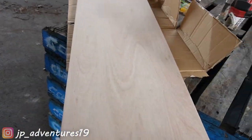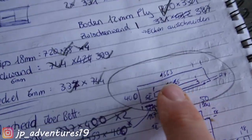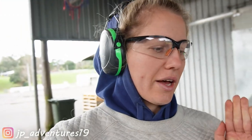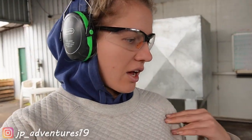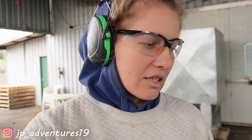The floor of the overhead cabinet is cut out and I already sanded it with the orbital sander at 240 grit. It's a bit tricky because I have to put a cutout in it — this cutout is for our motorized blinds. They go up and down but have to sit somewhere above the window, and our overhead cabinet is right above the window. We're just going to have this little cutout — like a little box that goes into the overhang of the overhead cabinet — and that's where the blinds will sit when they're rolled up, along with the little motor.